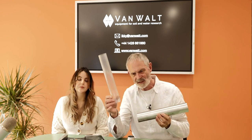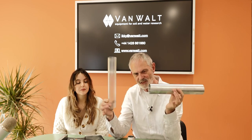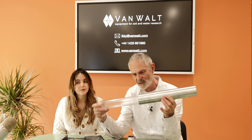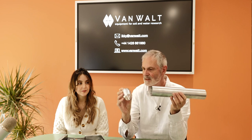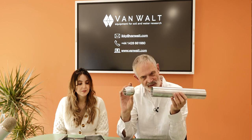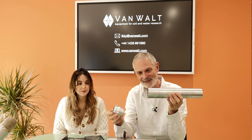Samples are taken in the liner. We have the chamber which takes the liner — the liner just slips in on the inside, and then on the other side we put a cutting shoe. With a standard cutting shoe, in these circumstances you may well need to use a core catcher because the sample may disappear.